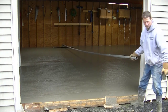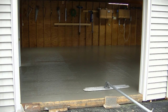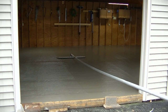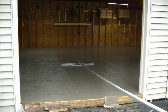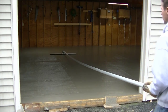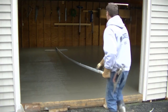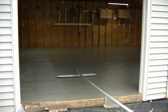You can see I'm turning those handles to the right and then a little bit to the left when I pull it back, walking it back and forth and pushing down the aggregate. I've seen videos where guys use a tamper to tamp the aggregate down and then bull float — I've never done that and I don't see why you would have to unless you pour the concrete so dry you couldn't bull float it. We've always had good luck just bull floating and then giving it a nice smooth finish, and then running a power trowel over it. There's absolutely no reason to use a tamper on a floor like this at this slump.